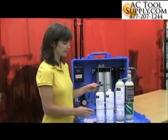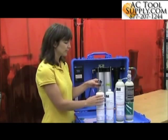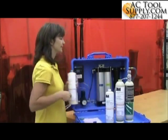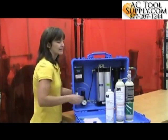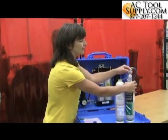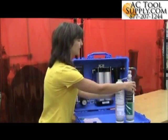The regulator that comes with the small kit does not have an on and off, so once the regulator is attached to the bottle, air is flowing. For the large kit, the regulator has an on and off, so you can help conserve calibration gas by turning the flow off when you don't need it.